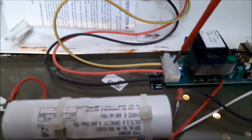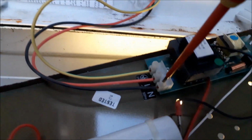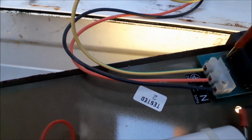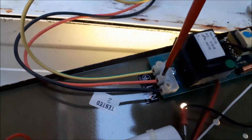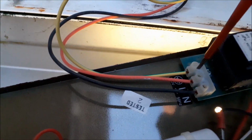So these light fittings, the emergency bulkhead lights, in the event of a power cut, they are supposed to last 3 hours. I think once a year, I think it is, that test is done. And at the moment, these ones are failing that test, so that's why it's being changed over.